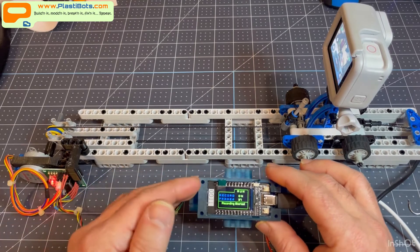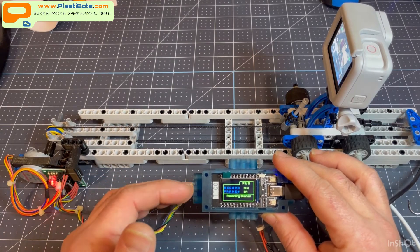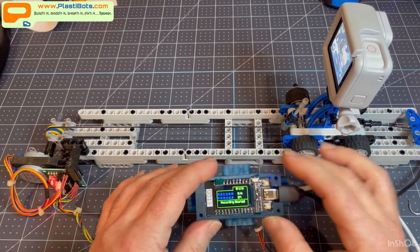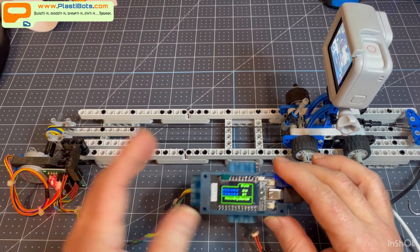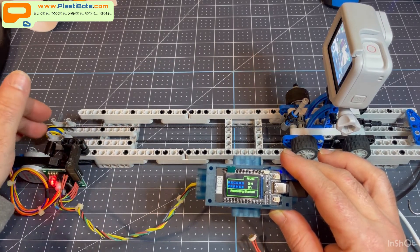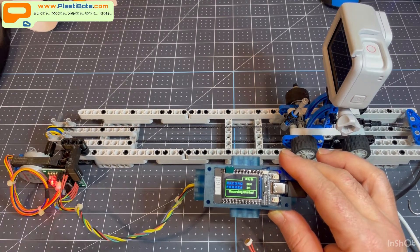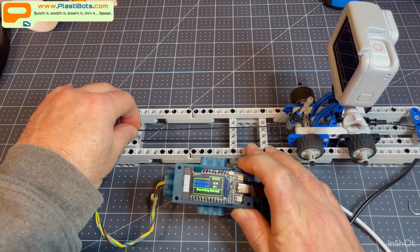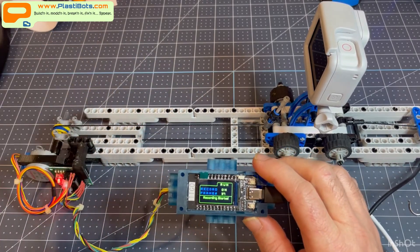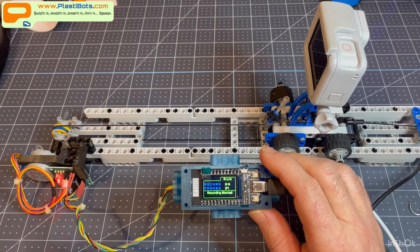You may be wondering about damage - I've hooked this motor directly to the 5V output of the TTGO. I haven't fully checked the maximum draw on the voltage regulator, but it does transfer 5V and I'm not worried about it. There's not a lot of demand on this motor. I've built it with a smooth wheel and a rubber LEGO elastic that easily slips on purpose, so if anything gets caught it just slips without causing the motor to stall, which would cause challenges.